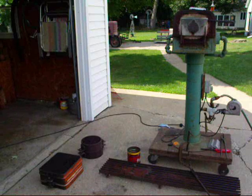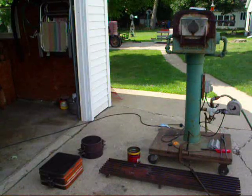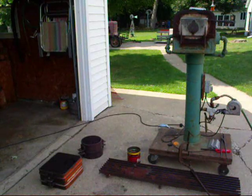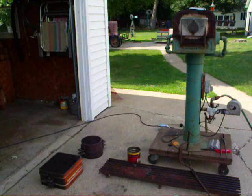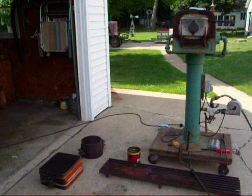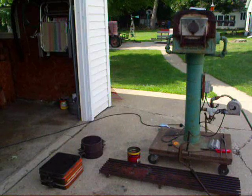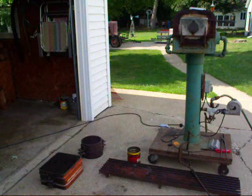Okay, it's been 20 minutes. The metal is molten and I'm going to open the door, set the pot on the ground on that grate, and I'm going to scrape the dross off — which is all of the impurities that have come to the top — and then I'm going to quickly pour the two molds. Notice that I'm wearing shorts; I don't recommend doing that. Do as I say, not as I do. Here we go.